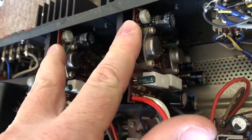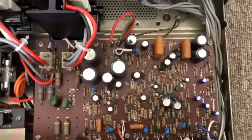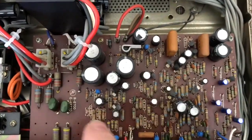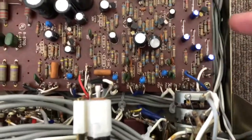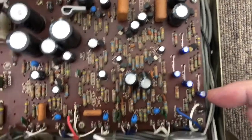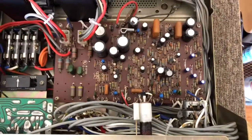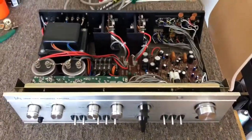On the main board I didn't do a lot either — I've left all the larger electrolytics and all the tantalum electrolytics. The only ones I changed were the input coupling one-microfarad capacitors, because they measured quite high for ESR. I replaced those with some nice premium Panasonic audio-grade coupling capacitors, which works very well. This amp now performs perfectly.